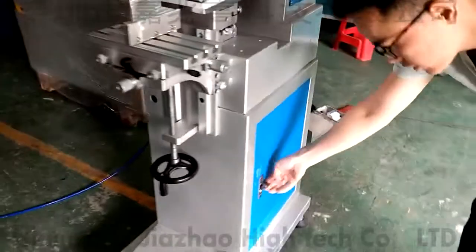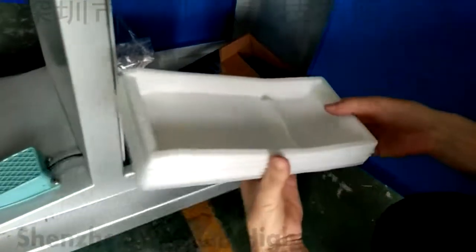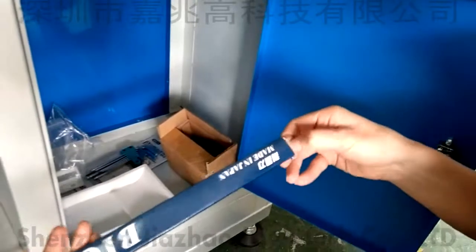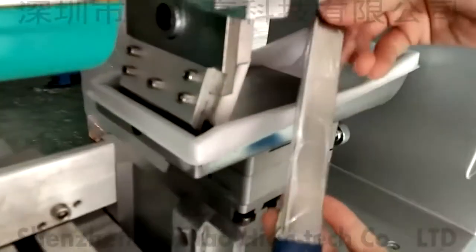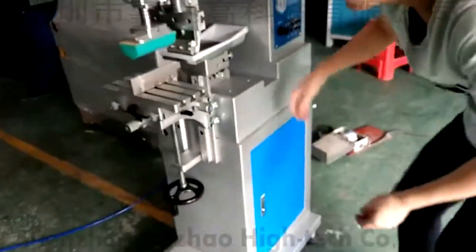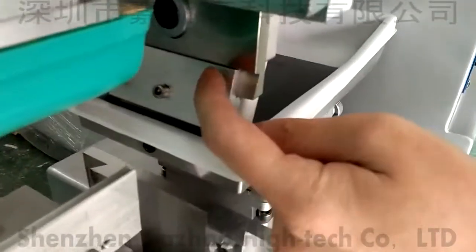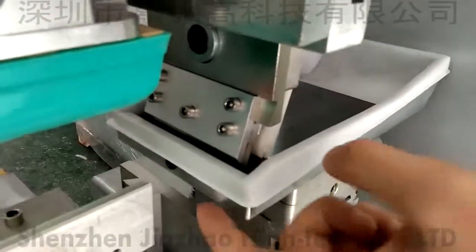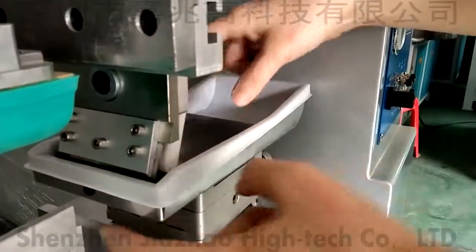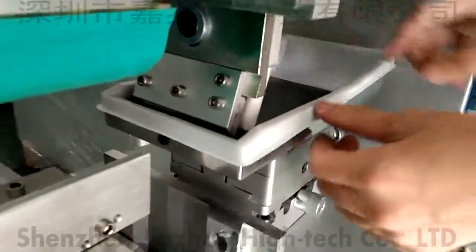Inside we also send you this — this is for the ink, this is the tray for the ink. We already give you this for spare. And this is the blade — this is the blade for here. We already give you the blade. When you need to replace the blade, you only loosen this screw and loosen this screw, and you can take it out. Also remember there's a screw here — loosen this to take out the steel mold. Loosen this, and you can take out the tray and the steel blade.